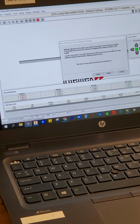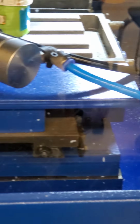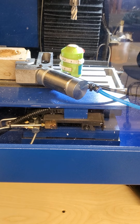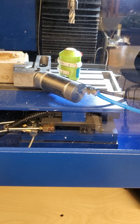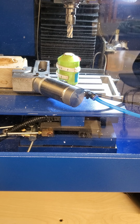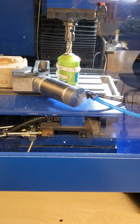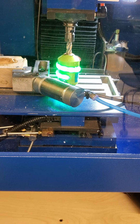And what that means is, what I've done here is I've taken and put a little jig that we made, a little fixture type deal. And what I'll be able to do here is lower my tool down, and when it touches, notice I'm changing increments so I don't smash anything. Right when that touches, the LEDs will light up. So as soon as that touches, I'm good.